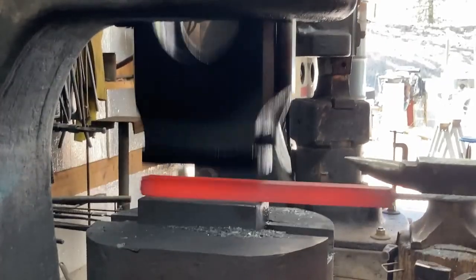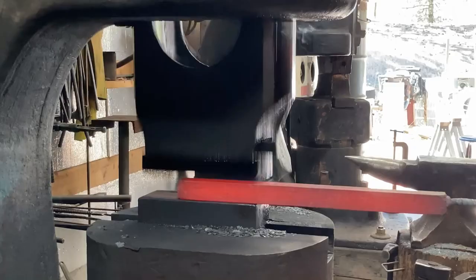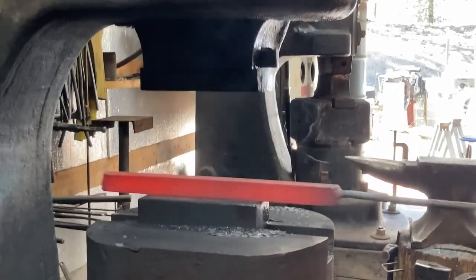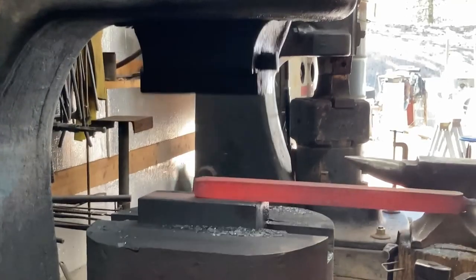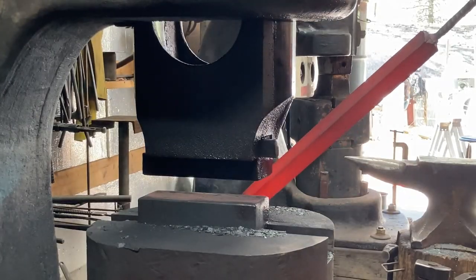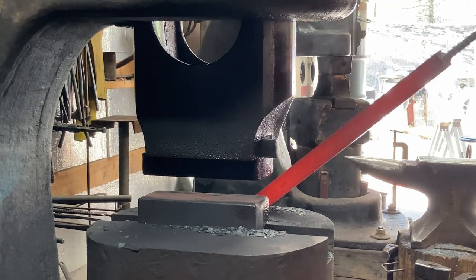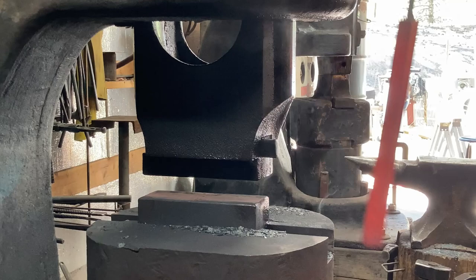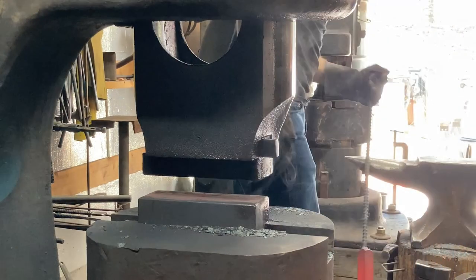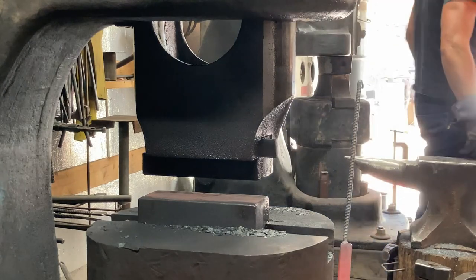You can see how slowly the bar cools when it's just thick and being hit continuously. Although I am coming into having to bandsaw it, I'm not going to worry about subcritical anneals or an oven anneal or anything like that. My experience has been that with bars of this thickness, they don't air harden much at all and they will bandsaw pretty readily as-forged with maybe just a little coolant.